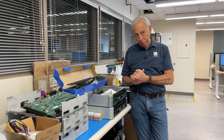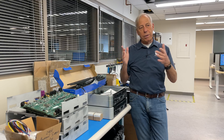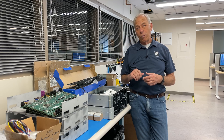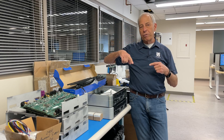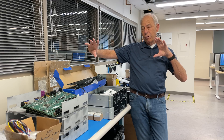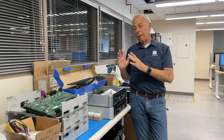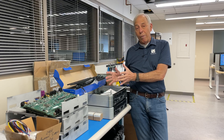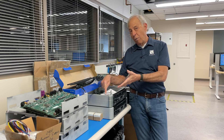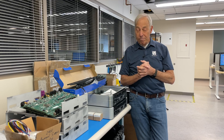In our BHK amplifiers — these are big amps, going from 650 watts down to 250 watts per channel — we use single-sex devices. We use a single N-channel MOSFET. We've got a bunch of them in parallel so we can handle all that current, but it's one-sex device going up and down. That is why the BHKs sound so magical, and why Javier's single-ended triode, even though it's only 4 watts, sounds magical. Single output devices have a magic to them that's hard to beat.